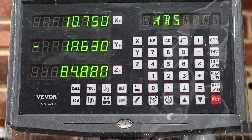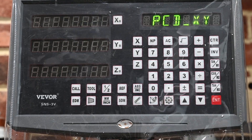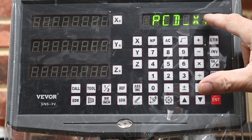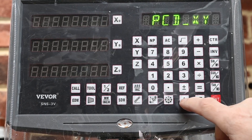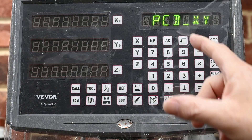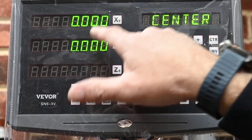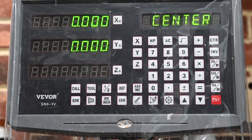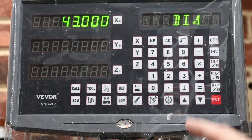The quill is not centred — otherwise these would be zero. For your hole pattern, you press the hole function and you can set it up for XY, YZ, XZ, or back to XY. We want XY because we don't need Z — we're not setting it for the downward movement. Press enter on that and it gives you the option to centre, which in this case sets these to zero, so you're all centred up. Then it gives you the diameter of your circle.